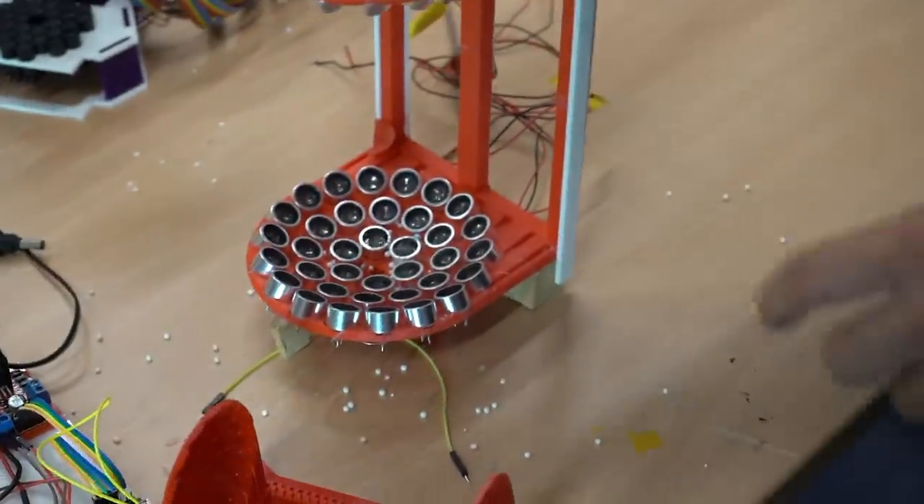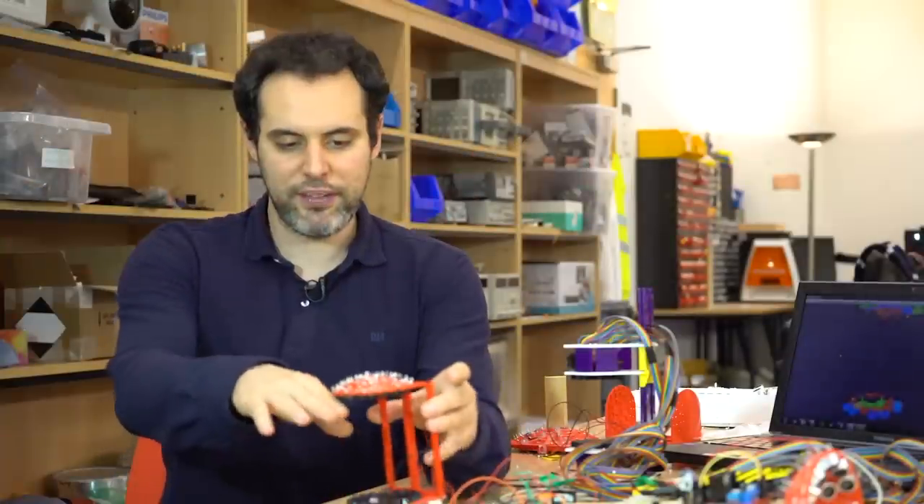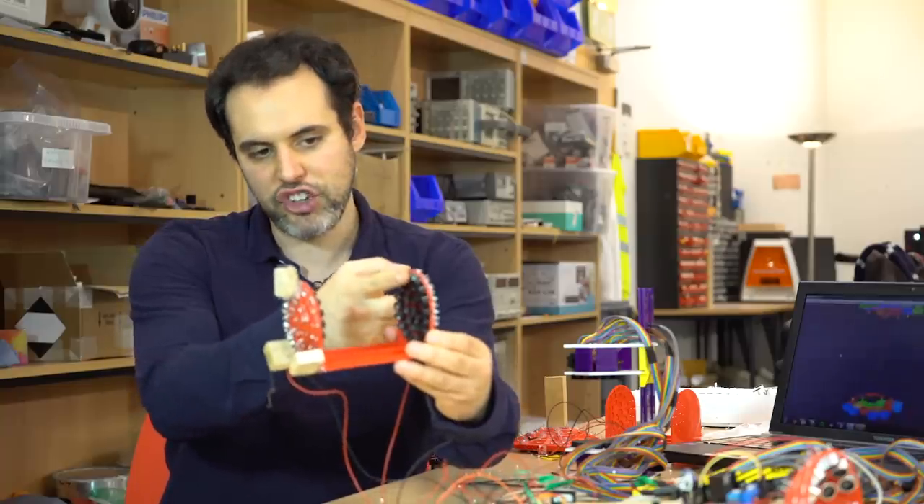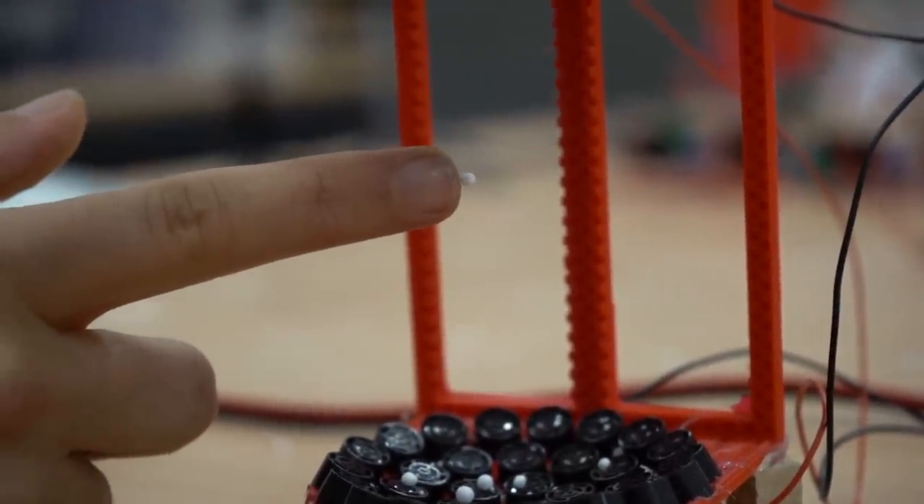It's more like acoustic tweezers. Acoustic straight jackets? Mosh pits? Metaphors are failing today. So how is it possible to make an acoustic levitator with a perfect 3D wave profile in your home? The key is this 3D printed shape. All these speakers need to be at a specific position and with a specific angle, and one way of achieving that is to design this base and 3D print it. If you try to put them in a flat surface, it wouldn't work as well. You can see that there is only one signal going to all the top transducers, and that's possible because the focusing is done by the shape. This has a bowl shape that naturally focuses all the acoustic power in the center of the levitator. The structure puts all the transducers at just the right distance so that all the waves add and cancel in just the right way. It was so they could democratize the technology — and it's super cool, which I think should be the only prerequisite for doing science. You can quote me on that.